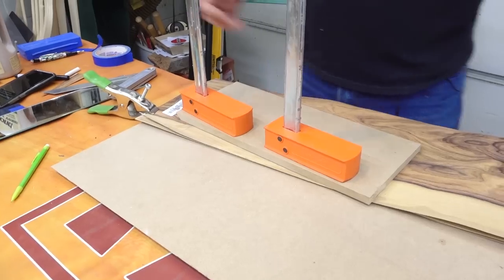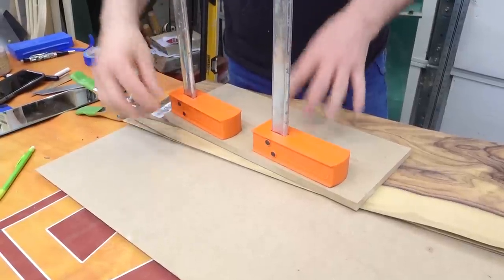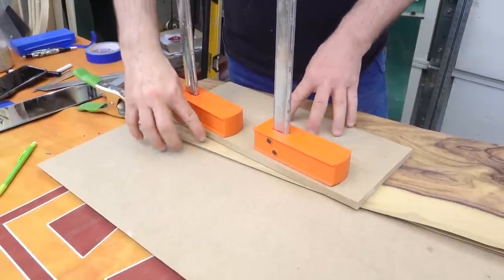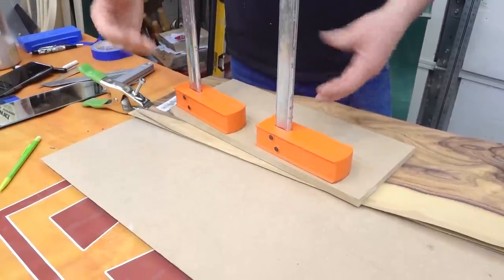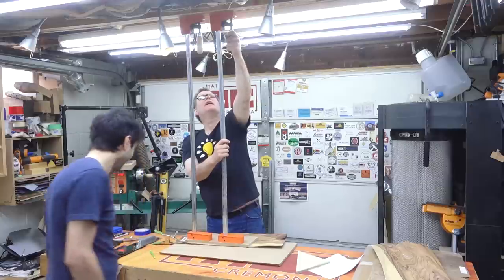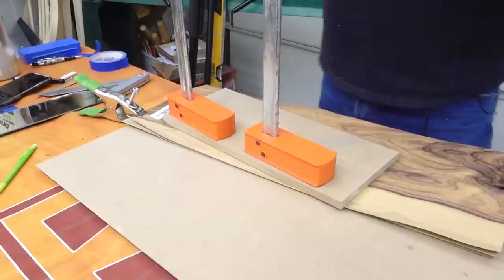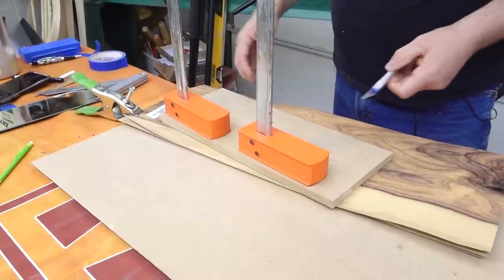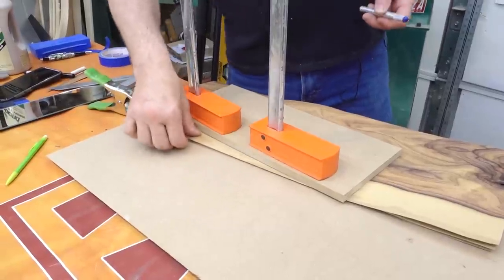There's a number of ways of cutting veneer. In this case, we're going to gang cut them all together. When you gang cut, it's really important that you compress all the sheets of veneer together tightly. You can do that with C-clamps or clamping to the ceiling. What we're doing, this is actually an old school method where you're actually using clamps. You could use just 2x4s and wedge them to the ceiling. But in any event, you want to be sure this becomes a sort of single piece of veneer.